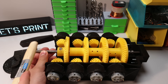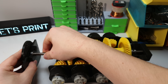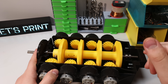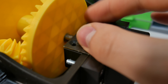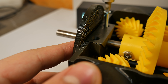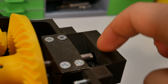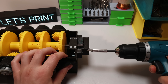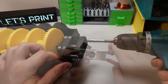Wait — the front side bearing has to be installed into the front cover first, and then the shaft has to be pushed through there. For the backside bearings, we install the cover with 4mm bolts. But there is one problem: the backside requires lock nuts and bolts to be installed first. So I quickly disassemble this and fix the problem.